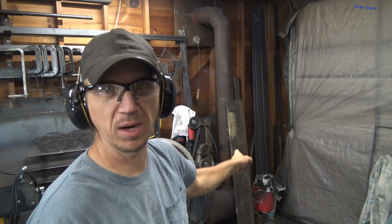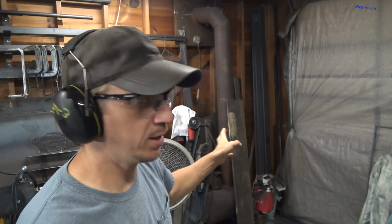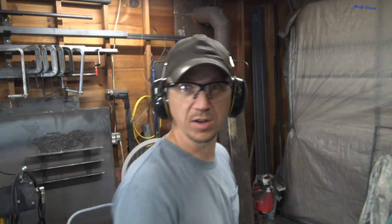Well, you've probably seen enough hard facing at this point in the video, right? What else is there to say other than I spent about 5 hours getting all the way around that auger. Just got done drawing the mounts for the reamers. I'm going to cut one out and try it, and I'm going to use my 1-inch scrap piece of plate here. I looked in my book. It should be weighing about 160 pounds right now. I'm going to lay this thing down and get onto it with a magnet.